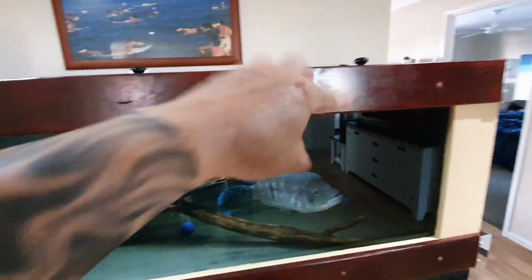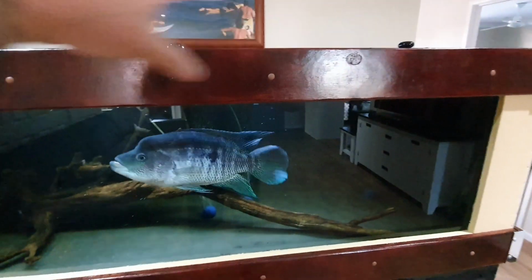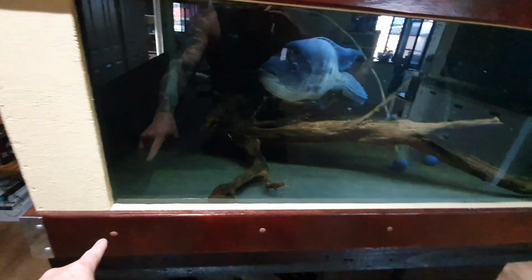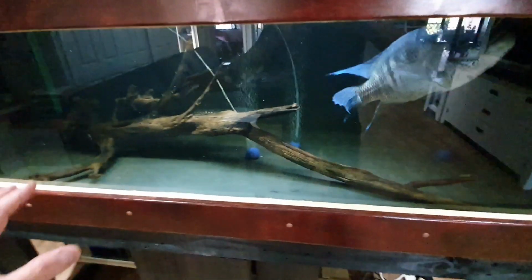So once you've put your 3 supports in, you screwed them in front and back, held it tight, you're painting all the inside of your tank black with the pond sealer, painting your supports black with the pond sealer. Then don't pond seal that 50mm gap around here. Leave that bare pine, and then you use your polyurethane for that nice smooth surface.